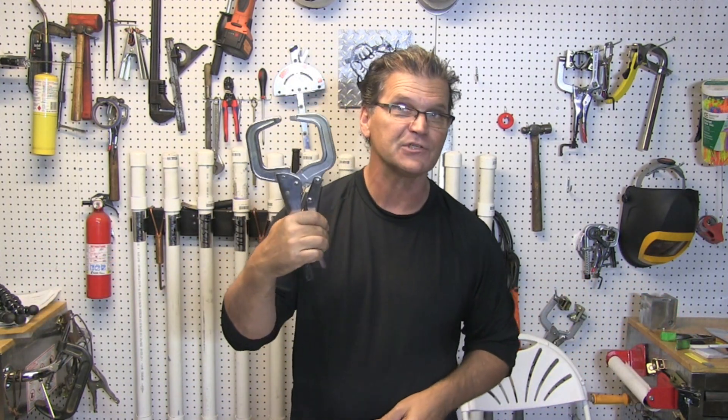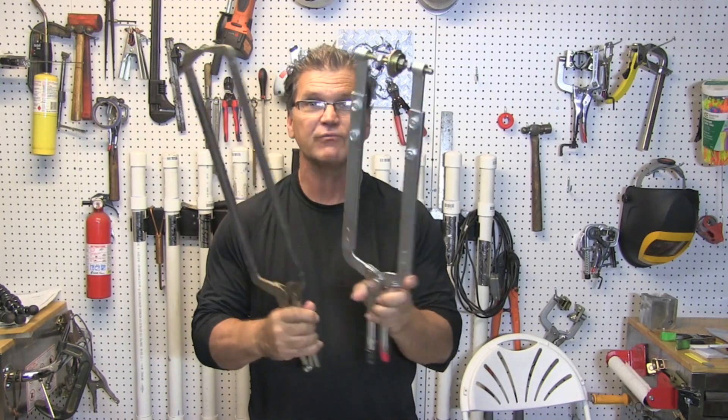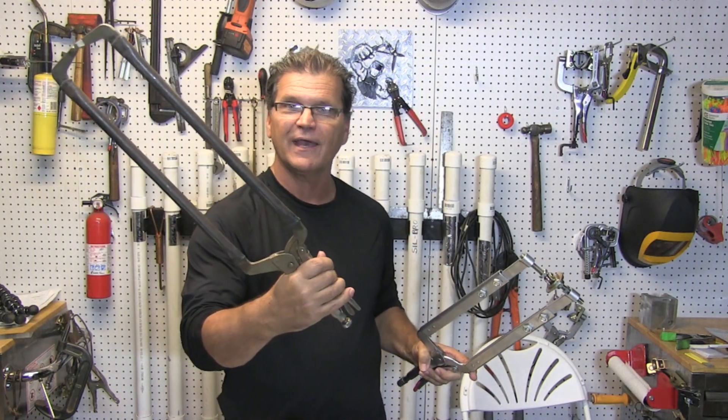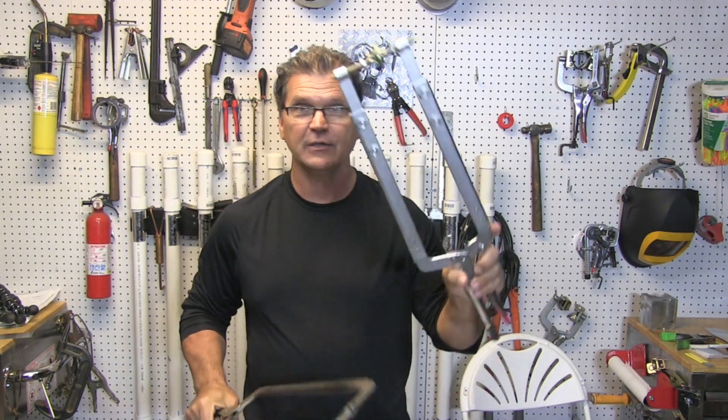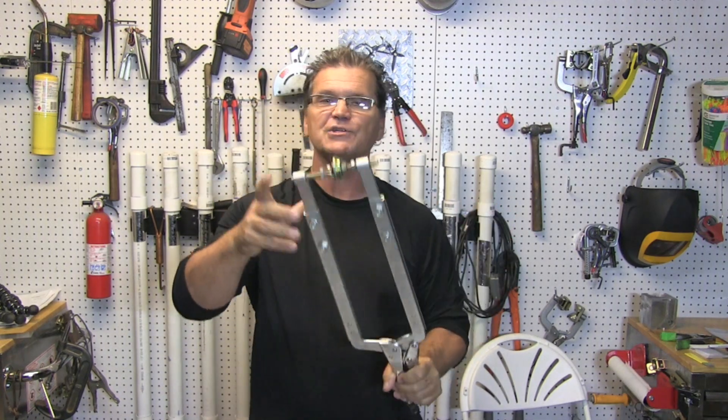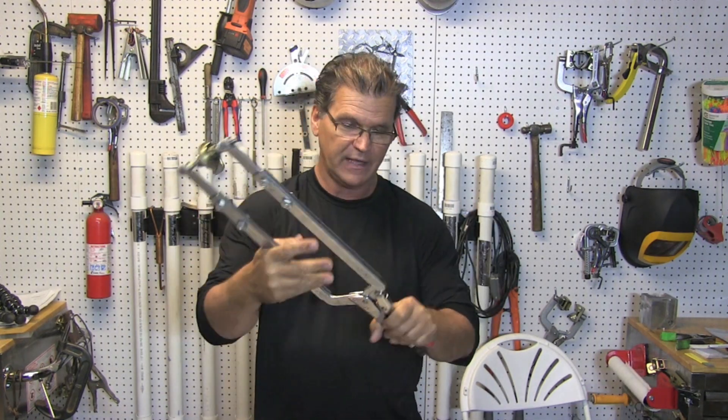Aluminum angle especially comes in handy — about a quarter-inch wall by about two inches, super handy for stuff like this. The piece I was welding today is only a two-inch strip by about three feet long, so I was able to use something very simple to clamp the chill bars. But a lot of times you need to get clamping jaws in far, and something like this really comes in handy. I modified one with some chromoly tubing extensions — works great. You can also buy them off the shelf; this Strong Hand Tools model has a little more adjustment and a swivel foot, which can come in handy. But I have way too many clamps — said no welder ever. See you next time.